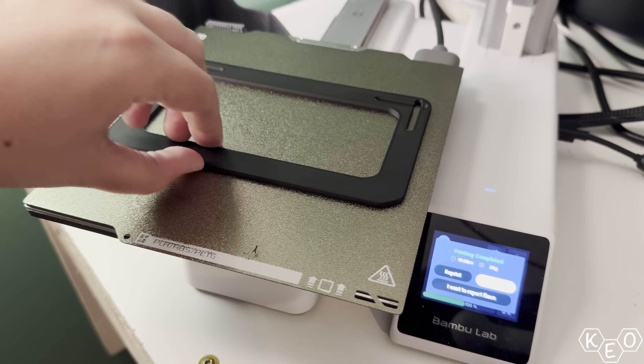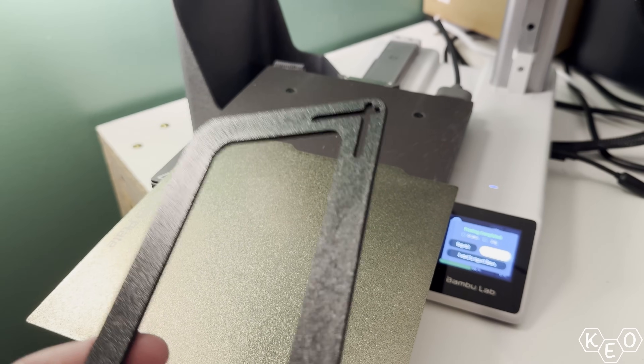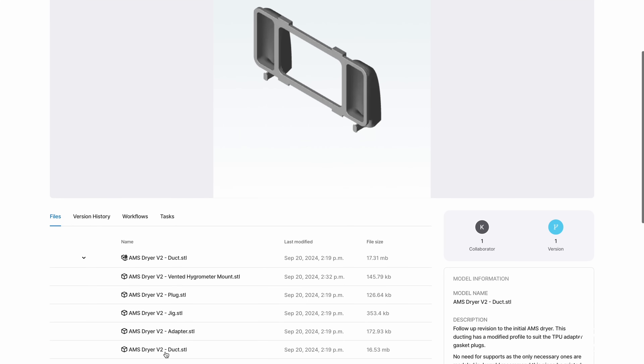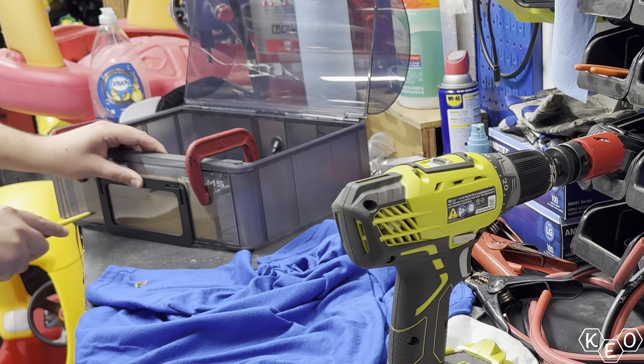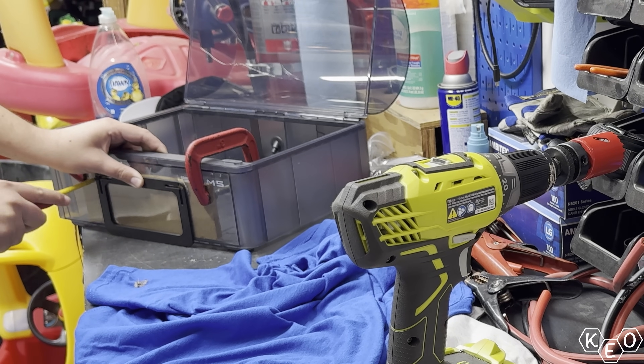The plugs and adapters were modeled and printed — that problem was solved. Now I needed to find a way to drill a consistent hole in the front with the hole saw at the correct height so the ducting would sit properly. I modeled this jig to help figure out where I needed to drill everything to make sure stuff would line up correctly. This is also going to make it super easy if you're trying to do this at home, so there will be a link to all the files in the description. If you've got a hole saw, you just put the center bit right in the crosshatches and fire away.